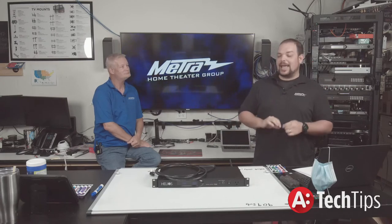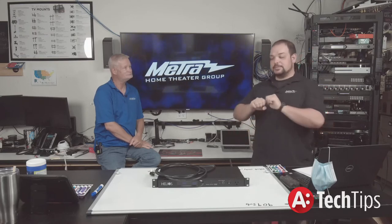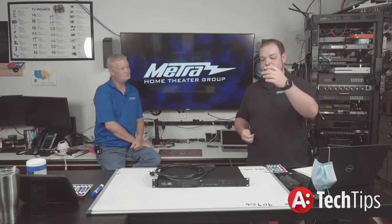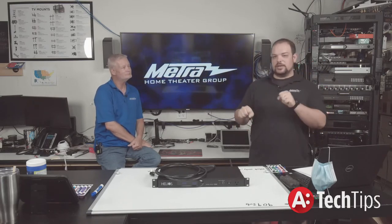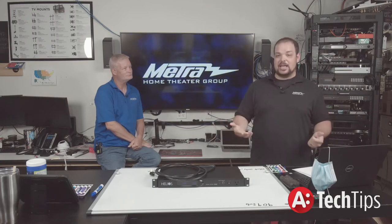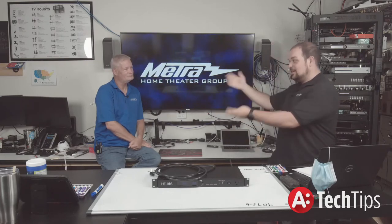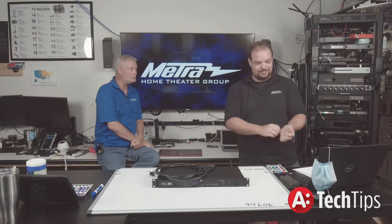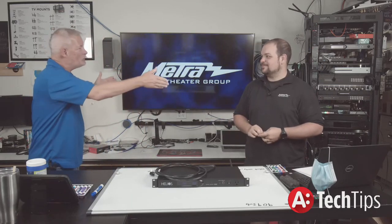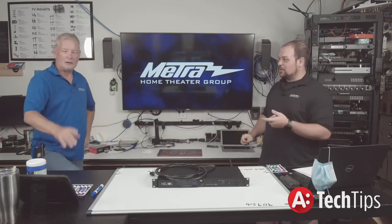So I wind up putting multiple lacing bars across the back of the rack — I can take the power on one bar over and down, and the networking and video on another bar over and down. What's one thing we don't want to do? Put power by anything else. Keep the power all the way by itself. Power needs to go away from any other connection. When looking at speaker wire, you want to get power away from it or you'll get a hum. For networking, power away or you'll get dropped packets. For HDMI, power away or you'll get noise and problems.